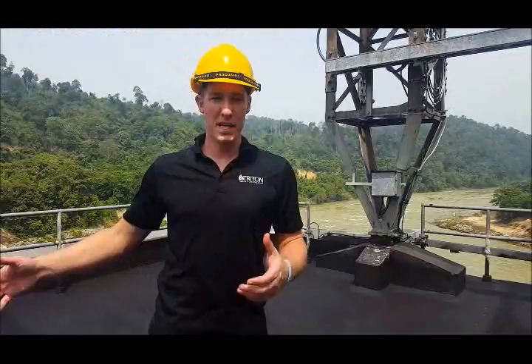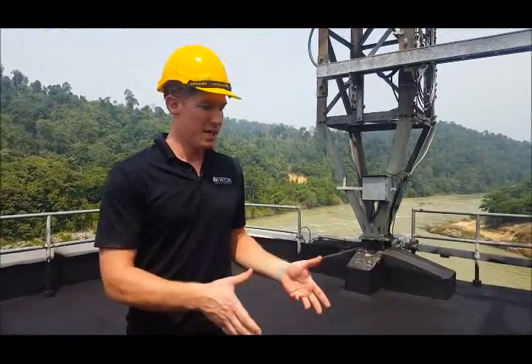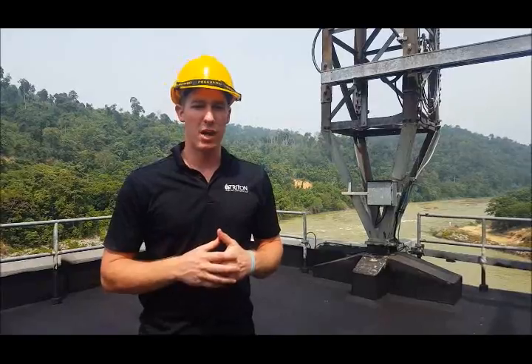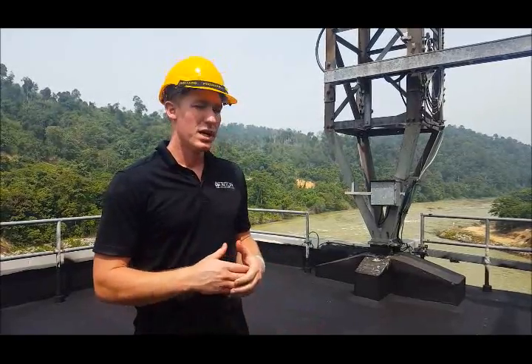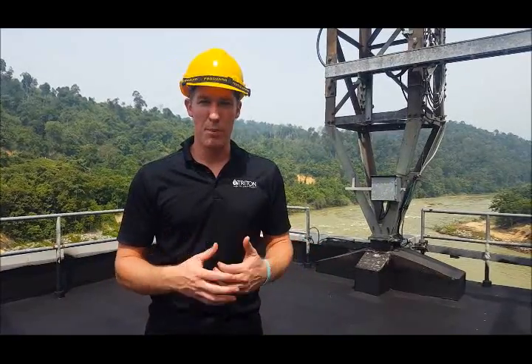What I'm standing on is a cured Tridoflex rubber membrane. This is the extremely flexible — 1900 percent elongation — very strong, durable rubber. After all that water evaporates out, it turns to this black, strong color.